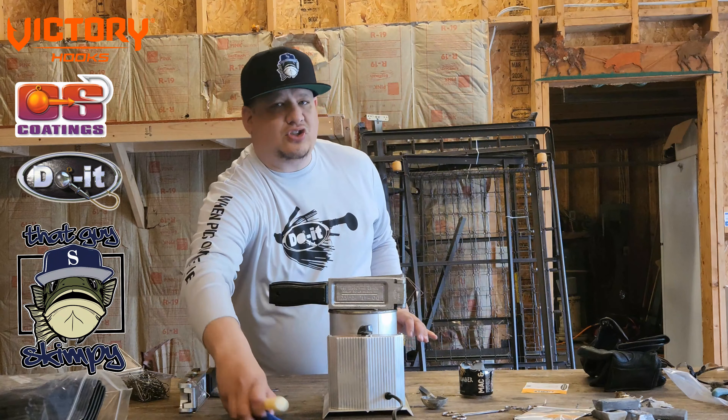This one's kind of smoked but we'll do it again. I'm just going underneath it — you just want to get it nice and black, and like I said it just helps fill the cavity and also helps release the jig when you're finished. The molds we're going to be using today are the Poison Swing Tail. The reason I use this one instead of the regular Poison Tail is because this one is not weedless, so you don't have to worry about a hole being in the bait.